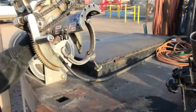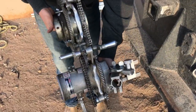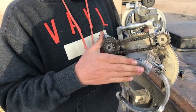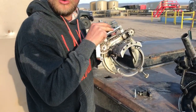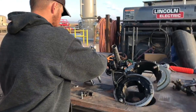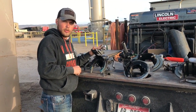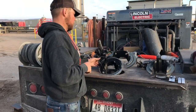Comparing an H&M to a Matthews, the saddle is about two inches shorter on the Matthews. What that's going to do is get you into tighter spots. You need more room to run one of these H&Ms just because the saddle is bigger. They're incredible machines but the saddle is just a little bigger, so I can get into tighter spots with the Matthews. Also, this bridge only adjusts a little bit — not a lot of adjustment — which means it's going to be square; you can't really mess it up.